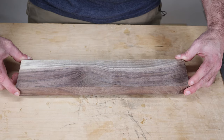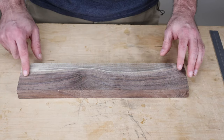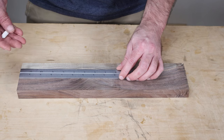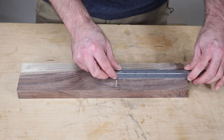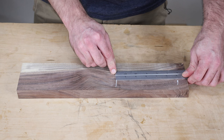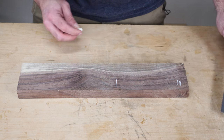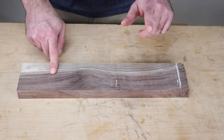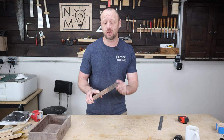I've got a piece of walnut here, picked on purpose because it has beautiful sapwood plus heartwood so we can really see that grain flow. We want to build this to be nine by six. I'll place a mark at nine for one long side, a mark at six, and then add the thickness of the table saw blade — in my case, one eighth of an inch. So I need a board that is exactly one long side, one short side, plus the width of the saw blade.